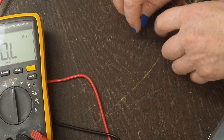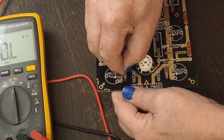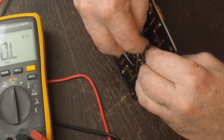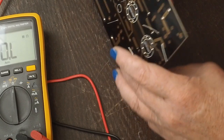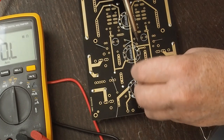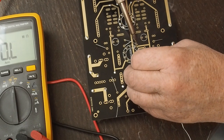It's another one of those things that I haven't really sat down and tested, but I've read people saying that that's where you end up with hiss, is using resistors that are barely capable of flowing the power that they're rated at, and they're basically straining. So, let's solder these guys all in place. Get my tip clean. A little fresh solder floating under the tip.